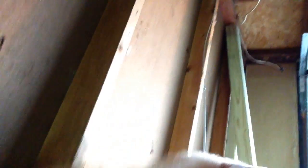I've got this one cut to length so that it fits just right on my bottle jack. I'm going to jack up the front corner, get my jack stand in place, then lower the jack, go to the middle, jack that up, put the jack stand in place, lower it down, and do the rear. Then after that this plate will be free — I can cut it out. You can see how rotted it is; it's just crumbling with my hands. The two-by-fours are in pretty good shape so I'm not doing anything with those. If they were weak at all I would sister board them — put a sister two-by-four probably six or eight foot right alongside to strengthen it.